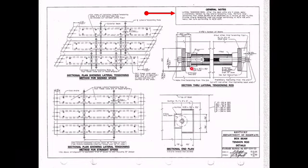The tension rods are designed with a keeper plate, a washer, and a nut. These get fully tightened. These are now a galvanized or stainless steel material, and then you do the non-shrink grout in the ends to lock it and seal it all up.